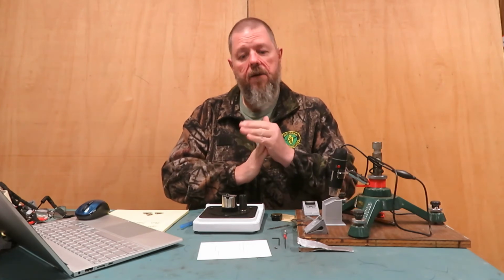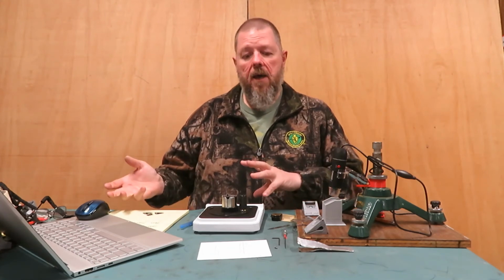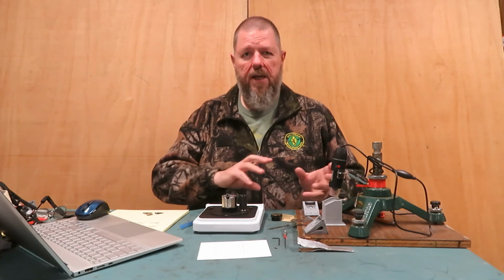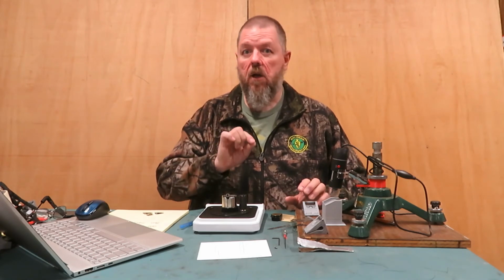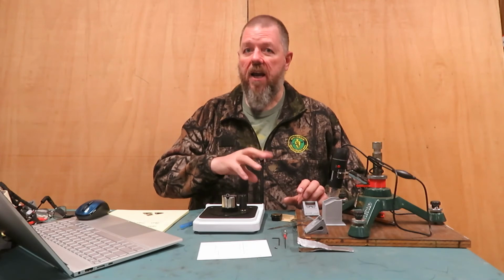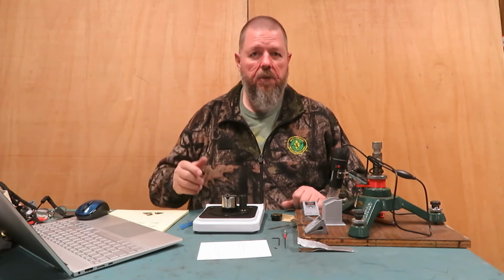Now do the other side and fold it over before you switch to the next grit. You will have removed all those scratches. If I try to jump from, say, 240 grit right away to 1200 grit, I'll never get the scratches out from 240, and my blade will still only be 240 sharp with a shine of 1200. That's why that gradient of different grits and the time spent on each matters.